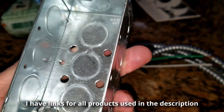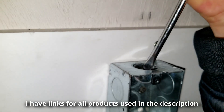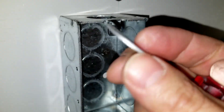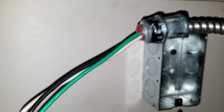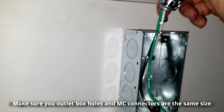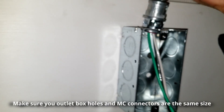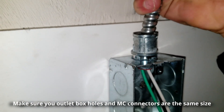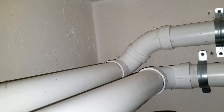This is the metal outlet box I'm going to be using — I already have it mounted on the wall. I'm using a screwdriver to tap out the knockouts and they just fall out easily. The important thing is the MC connector has to be the same size as the holes on your outlet box — in this case it's half inch. You just push the connector into the hole and you can hear it snap in; the barbs keep it from coming loose.